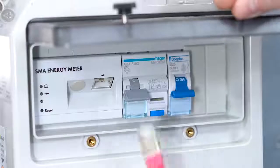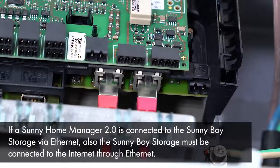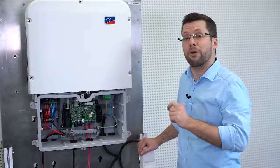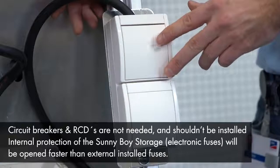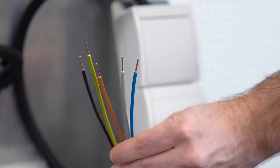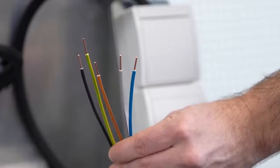SMA recommends connecting the communication cable from the SMA energy meter or SMA home manager directly to the inverter. The connection to the internet and SMA's online monitoring platforms can be achieved by using the built-in wireless LAN or by using the second Ethernet port. The new Sunny Boy Storage comes equipped with secure power supply. This means that even during grid outage, you can power a socket. If you need guaranteed power supply without any comfort losses, you can select our optional battery backup boxes even as a retrofit. In our system, we use the secure power supply. I have already mounted and wired a surface-mounted socket with an additional standard switch, for example a light switch. The switch is necessary to enable the secure power supply. In general, you need a 3-wire cable for the AC secure power supply connection and one 2-wire cable for the switch. In our example, I chose only one 5-wire cable with the right cross-section to reduce wiring efforts.